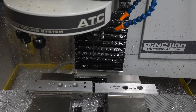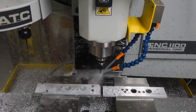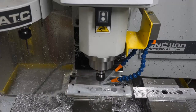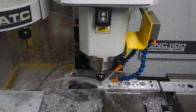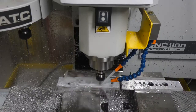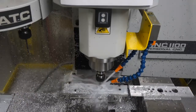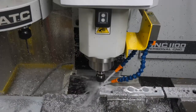Now we're going to move to the second operation on a tooling plate with the piece held in place with four 8-32 screws. We're going to also be using the Lakeshore carbide roughing cutter at a fairly aggressive 55 inches per minute speed. Once again, I tried doing this tool path with full depth of a quarter inch and the machine wasn't happy — it was chattering and making funny noises. Doing it in two passes, I'm pretty much using all the available horsepower.